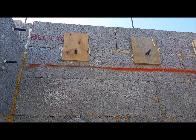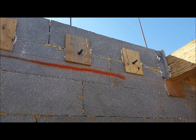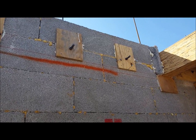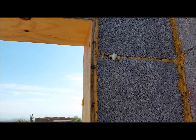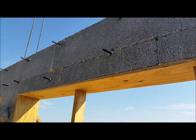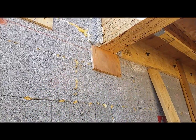These are the dams we were talking about. We're doing this a different way here - we're not dry setting the ledger, so we had the holes there and then you put a dam over there and let the concrete come to the surface. These are the bolts here for the garage door backing - they don't need to be dammed out, there's no pour on them, that's just to put the backing on there to hang the garage door. We'd dam up there so we want solid grout under those glass block windows.